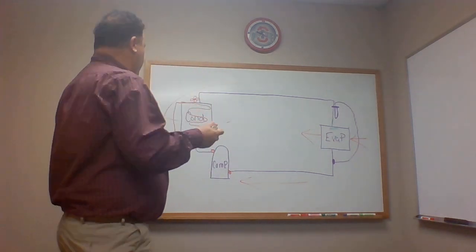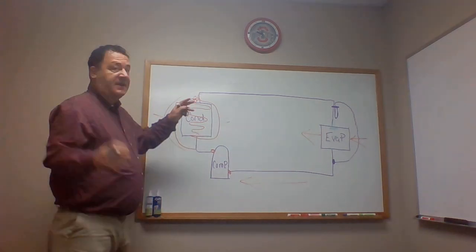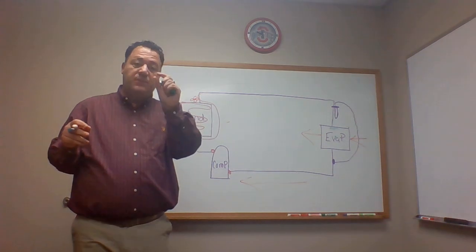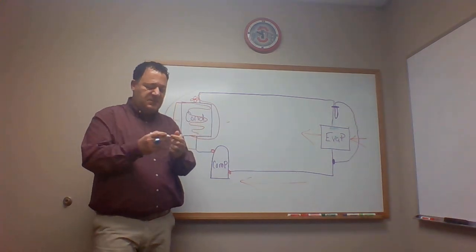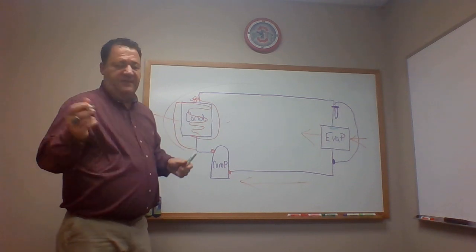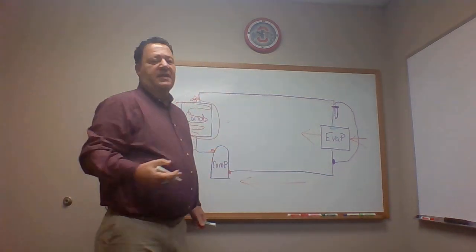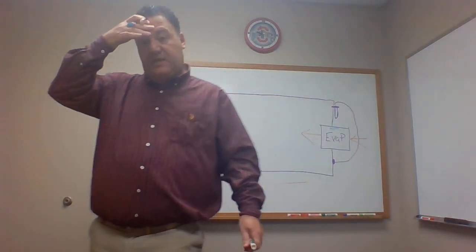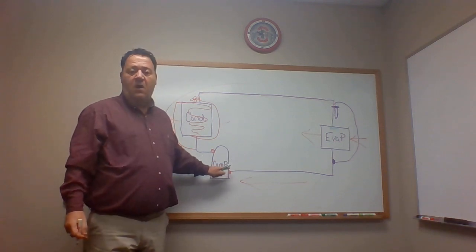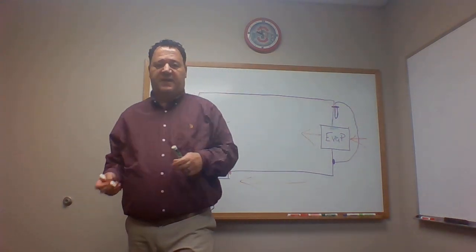All right? So we've entered the condenser. We've come out of here, come down here a liquid. Now we've condensed. Therefore, hence the condensing, we have a smaller liquid line. We don't need as much space, right? Now we're going to go down to our metering device. We all know what the metering device is. The first answer I'm going to get is it meters, right? It meters. And just as important as it is to have vapor going into our compressor, all superheated vapor, we have to have a full column of liquid going into our metering device.